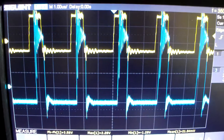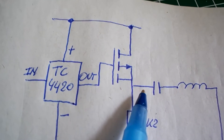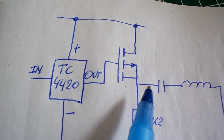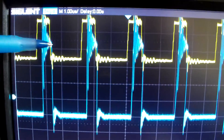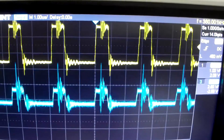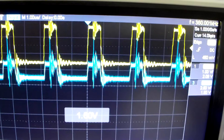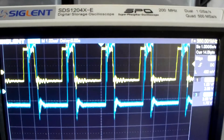In this part of the movie I added the coil to the circuit. I am now measuring on this connection using a differential probe, because I need to watch out for the scope and the spikes. The phase shift that you see between the two is not coming from the differential probe. I can show it when I connect directly to the signal generator — you see there is no difference. When we go back to that capacitor, you see the phase shift.